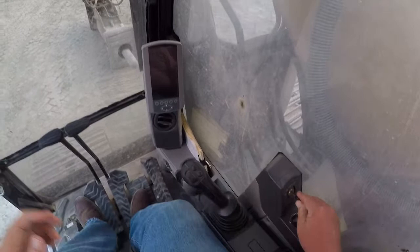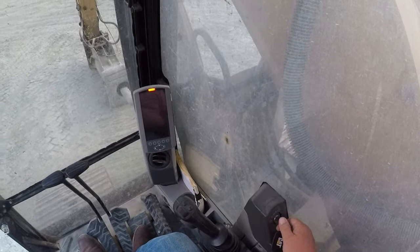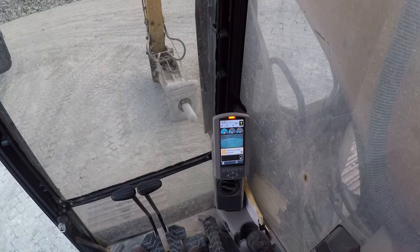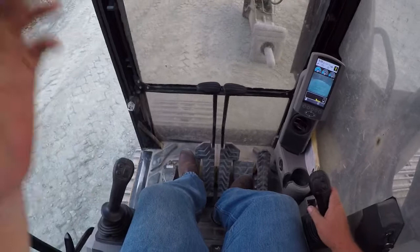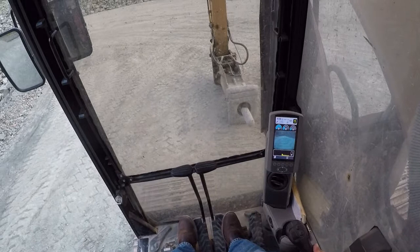We put our key in — this also has an emergency shut-off when you turn it all the way back. Then we'll turn the key on and it's going to power up. Check to make sure everything comes into play, check service information — everything's good to go, and we'll fire it up. We have what you call a warm-up mode. Once that goes out, we want to check our safety features: leave the lockout down and operate the joysticks — wiggle them around, we should have no functions. Tram back and forth, check our horn — we confirm the safety functions are working.